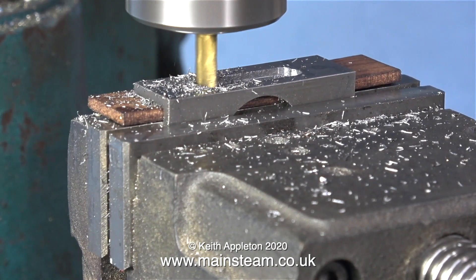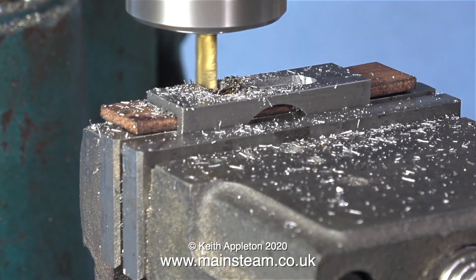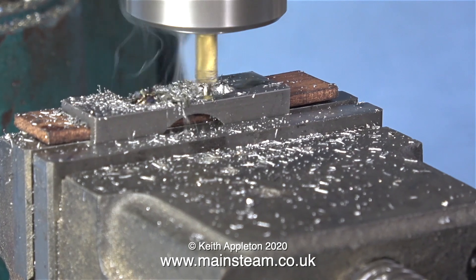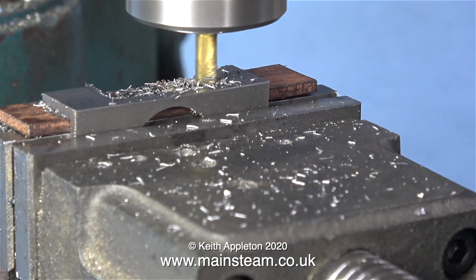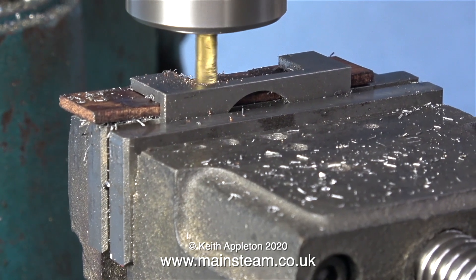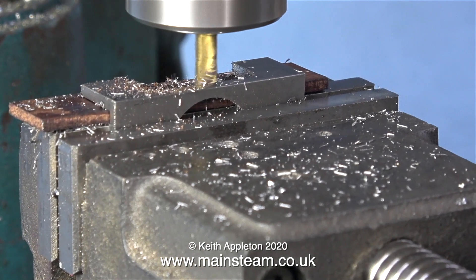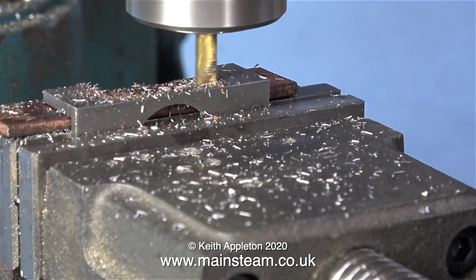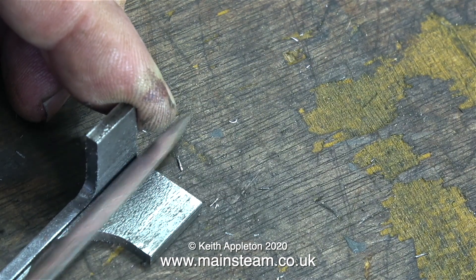I will only mill up to the marked lines once I've taken out the center of this piece of metal. There are different ways I could have done this — I suppose I could have used my bandsaw, but instead I'm using a milling cutter just to show alternative ways of doing things. Usual health and safety warning: you must wear eye protection when doing jobs like this. After removing the center I very carefully followed the line all the way around the edges — this is a critical part of the job and it's very easy to go wrong. A recommendation is to take a very fine cut so that any error will not be too bad.